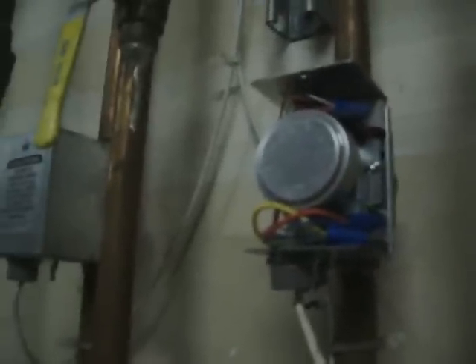I took off the cover. I turned the heat all the way down in that room so the zone valve would be off, and I did not have to worry about it turning back on when I put the new motor in. I ended up taking out these connectors. I replaced the motor — put the new motor in there — and then I went inside. I turned the thermostat up, and nothing happened, so I figured it must not be the motor.